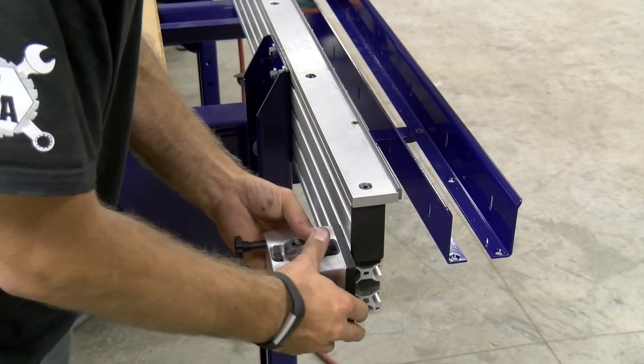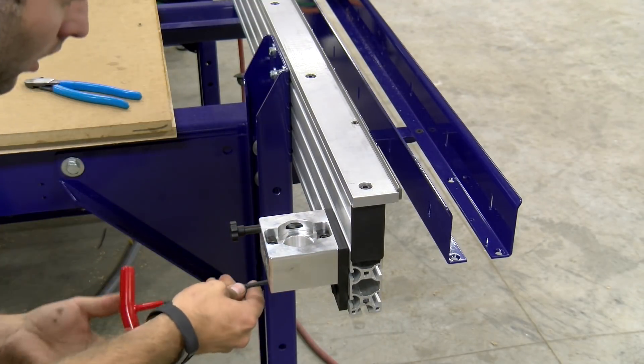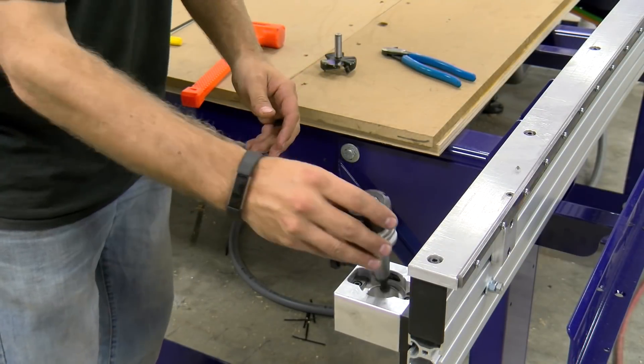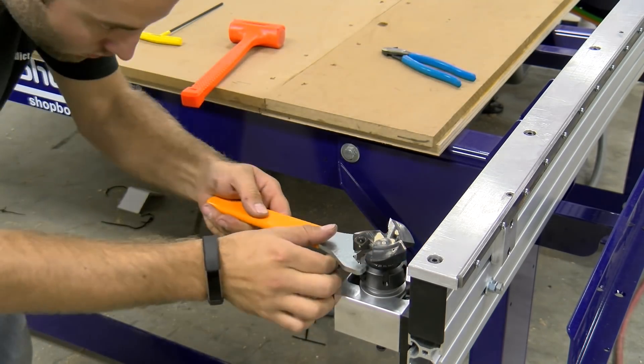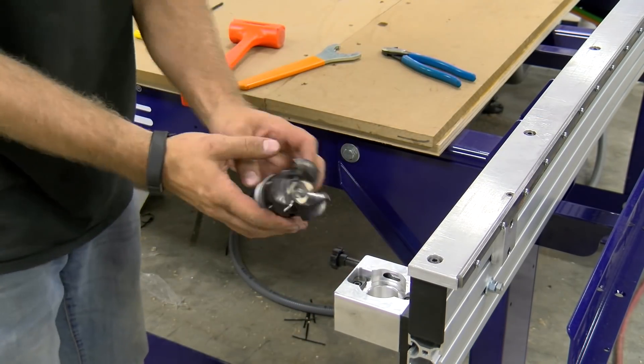On the ATC side of the unit we installed a tool holder vise, which screws to the main gantry and lets you secure the tool holder in place while you put a tool into the collet and tighten it up. We then installed a large spoil board or surfacing bit to flatten and level the surface of our CNC.